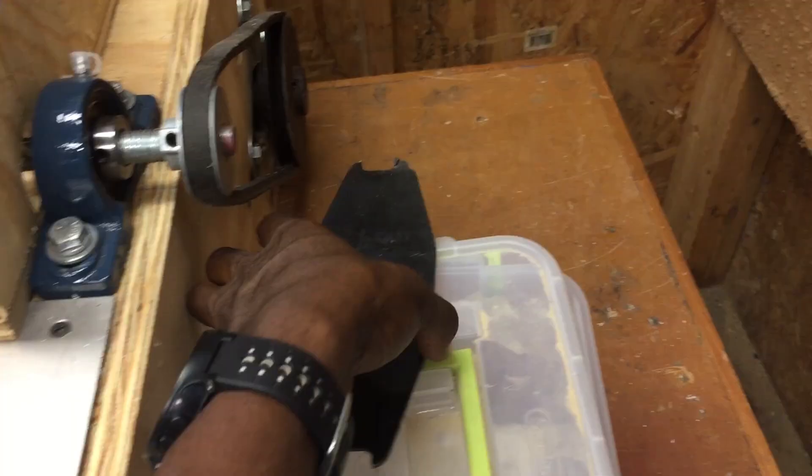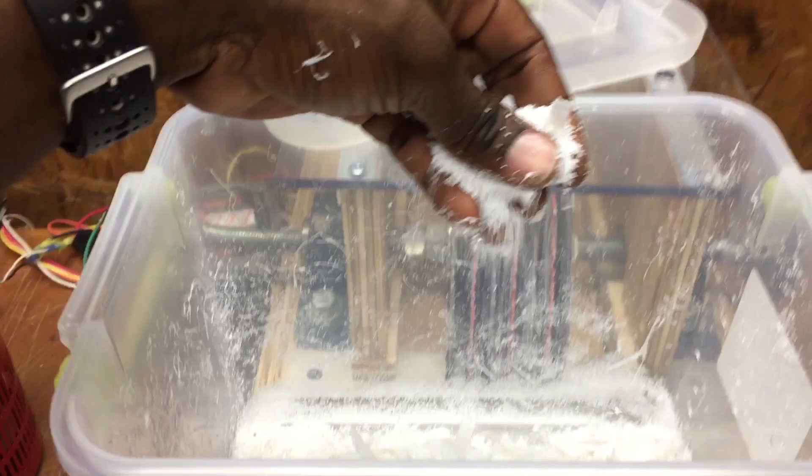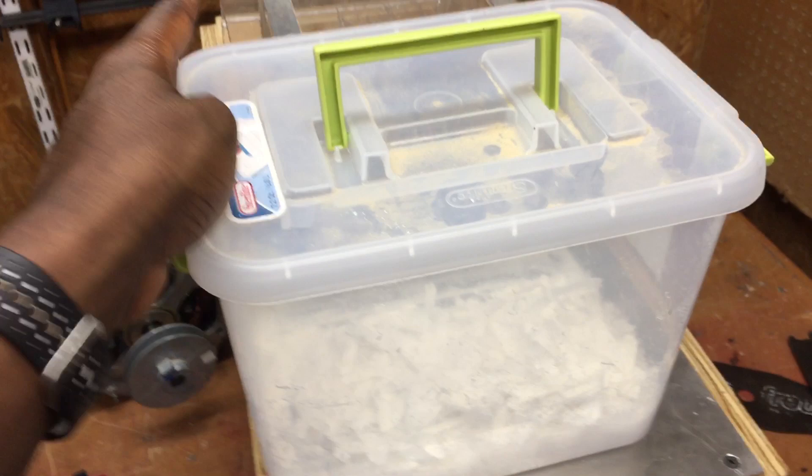Fred, one of my neighbors, suggested that when you shred the plastic really small — like this granular stuff here in the corner — you end up not getting a proper melt. He had some issues with melting and even sent some pictures, which was awesome. You're always so engaged with my videos. Thank you for all the feedback — let me know your experiences. All my tinkerers out there, I want to talk to you guys. If you send me a comment, I'll respond. Let's work this out together — that's why I like doing this.